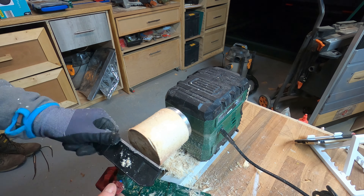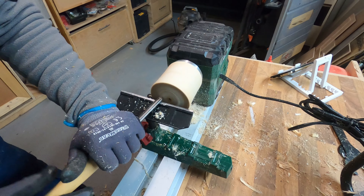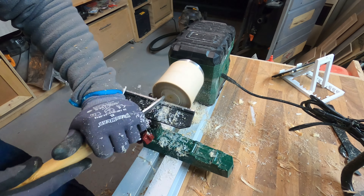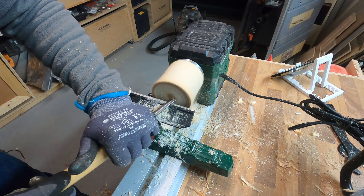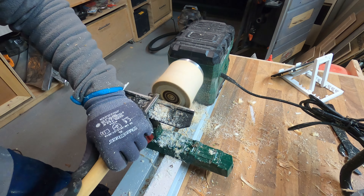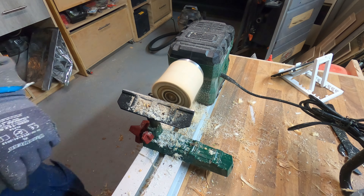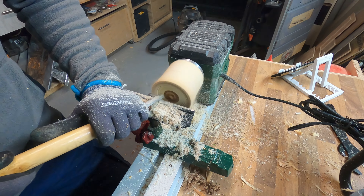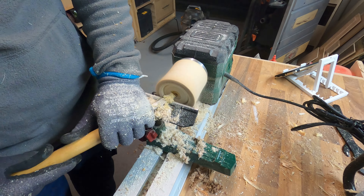When I was happy with the exterior and it was nice and smooth, I pivoted the end and was able to cut the inside. I did get caught quite a few times — you'll see the chisel sort of jags out of the way. This gouging tool was okay to a point, but it didn't remove anywhere near as much material as the other one. When I got near the middle it would kick back or jump about a little bit, and if I pressed too hard you'll see it sort of burn in. I'm sure this is user error, and I know someone in the comments will tell me I'm doing this wrong, but I was being incredibly safe all the way through — hands in a safe position and wearing gloves.